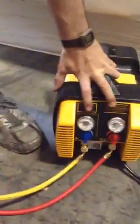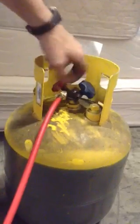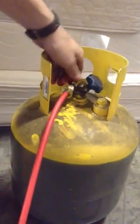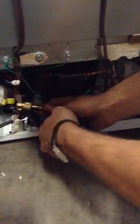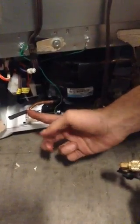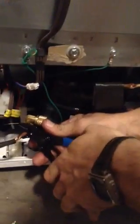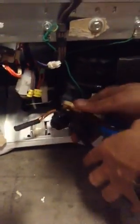Make sure the tank is open so that Freon can flow in there, and then turn it on. Once you do have it on, this is the part we actually attach to the machine. You're going to find the copper piece — it will be this little short stub here. It will look like it's usually crimped off and cut off, but it's not. Make sure that your little needle here inside is going to go right on the center of the metal. You don't want it to go off to the side.